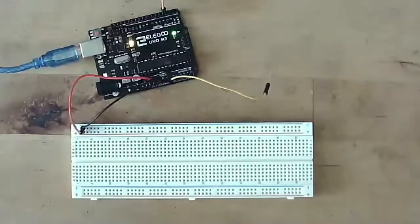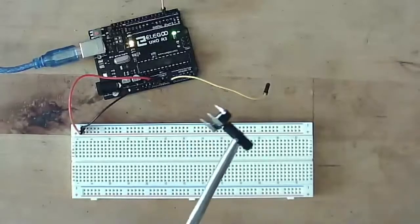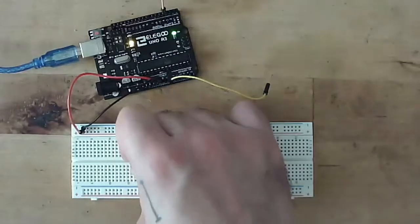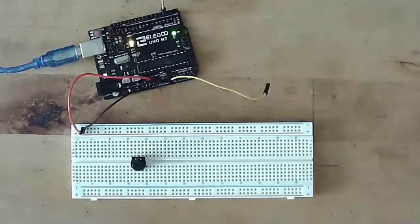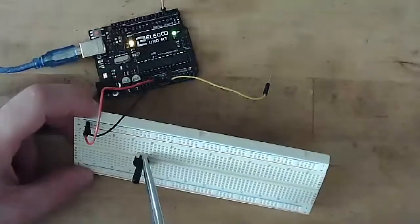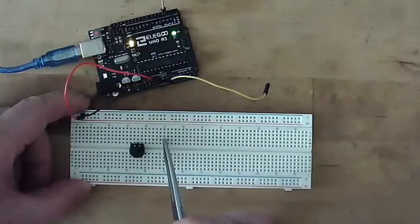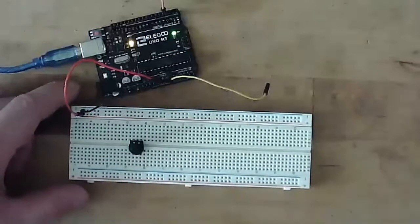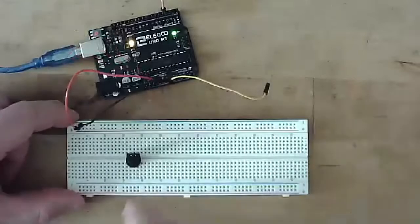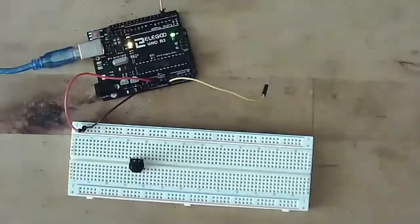And so the potentiometer, if we look at it closely, we have three connections on there, three legs on the potentiometer. I think it's easiest to put it bridging over that central channel on the breadboard. But the main thing we want to keep track of is making sure that none of those connectors on the potentiometer are in the same numbered row, because we need all of them to be electrically isolated, not shorted out on the breadboard. And it can take a little bit of force to get it to go into the breadboard, but just be careful not to mangle it when you're jamming it into the holes.